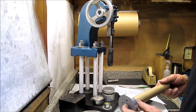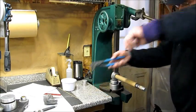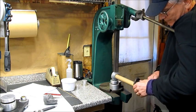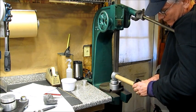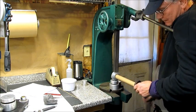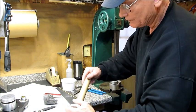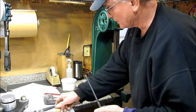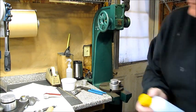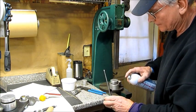Now I'll use the same process I used with the hand-rammed half-inch motor to remove the motor from the spindle. Holding the press onto the motor, I put the solid rammer into the hollow top end, grip that hollow area firmly with channel locks, and just twist — twist that motor right off. I had lubricated this spindle before pressing the motor, so now I clean the spindle up and hit it with a shot on all sides with dry lubricant, and it will be ready to go next time.